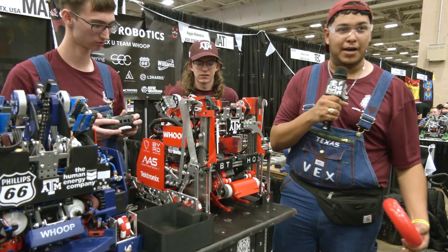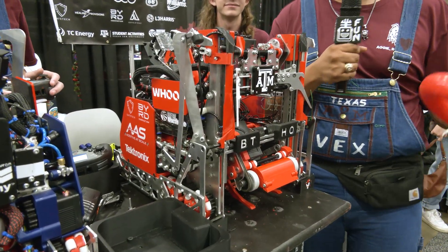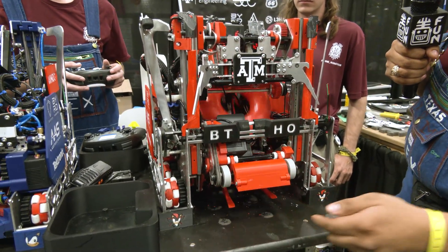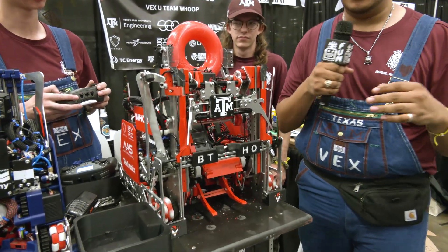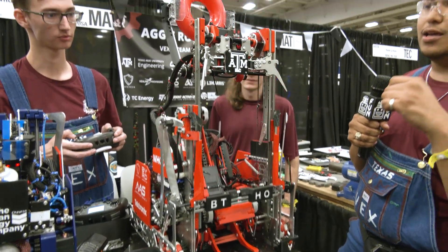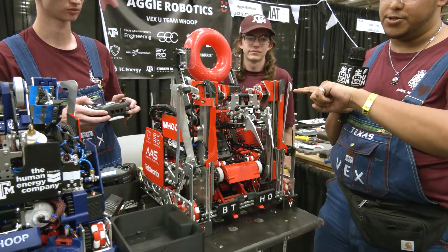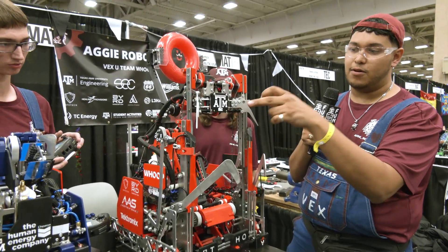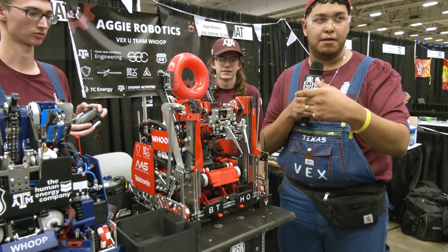I'm Everett, the driver for Shadow, our 24-inch robot. I'm going to walk through all the steps to get ourselves to a Tier 3 high stake scoring. The first step is activating our load position for our Roger Roger mechanism — it intakes the ring, gets loaded up, and goes up to a preset position. Then we retract our intake, go up to the cone, and activate our lift PTO. We go up, use our inside hooks to clamp over the bar, then use our hard stop to go down and pull up. We use our outside hooks to stabilize ourselves stationary so the base stays into the next tier. Once stabilized, we unclamp, open our clamp, go up, clamp onto the next tier, and pull it back down. We repeat the process until we get up to the high stake.